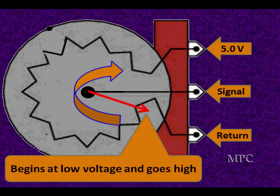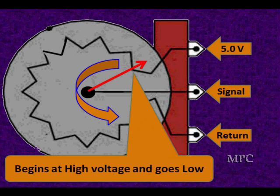Some of these start off low. In this illustration, the wiper is right down at the return voltage and goes from low to high. We're showing this as clockwise — but don't assume that. If we swap the five volts and the ground, it would have to be counterclockwise. The direction of rotation is determined by which pins have the five volts and return.